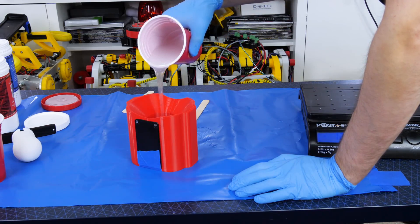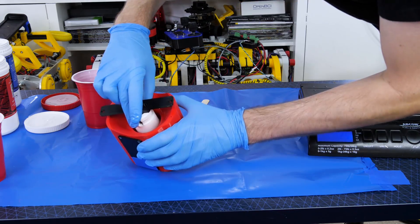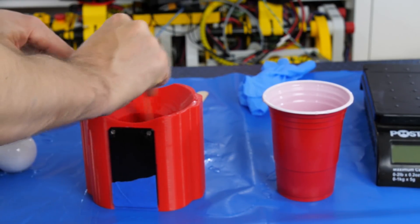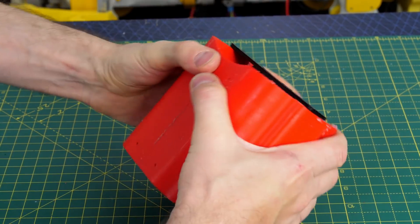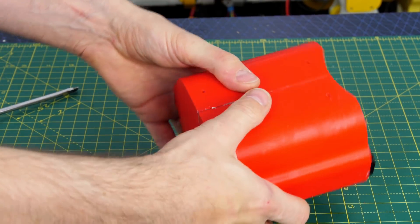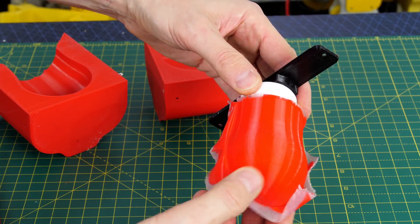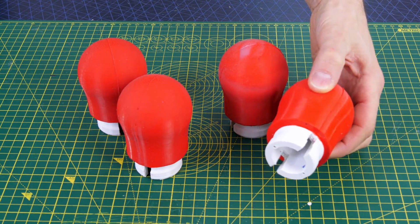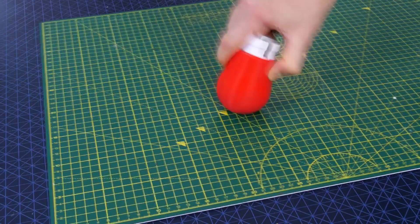At that point I decided to pour it in the mould. I don't have a vacuum chamber to suck out all the air, which is what you're supposed to do with silicone moulds, so I'm trying to do a high thin stream and then shoved the insert in and swished it around to try to get rid of any air bubbles. I forgot the silicone pigment though, so I decided to mix that in the mould and then reassemble and screw it together. Once it had cured it was really hard to open the mould due to suction, so I ended up prying it apart with a screwdriver, but the results are pretty good. There's a bit of flashing where silicone seeped between the two mould halves, but overall quite good results. I did that four times — now we've got four rubber feet each with a rigid insert that stops the carbon fibre tube cutting through the rubber, and these are much grippier than the TPU ones.